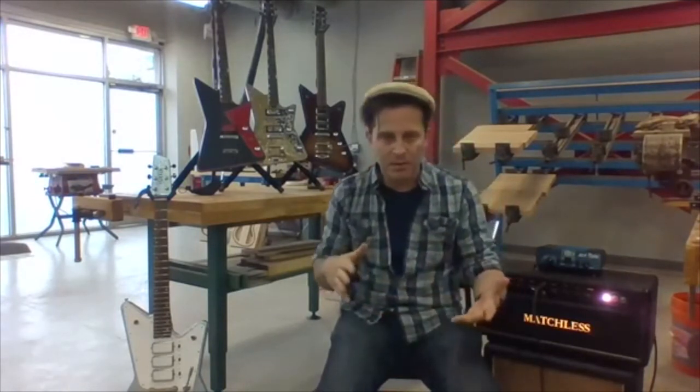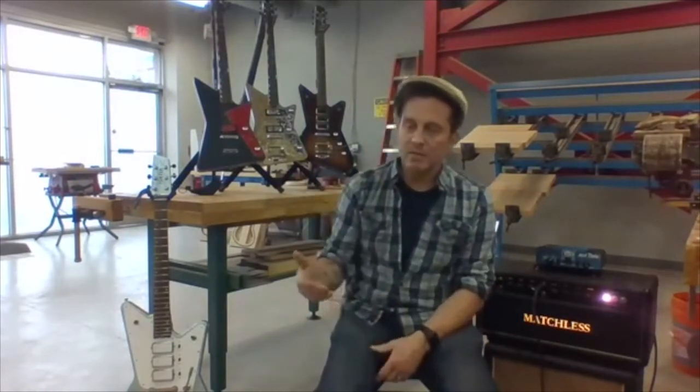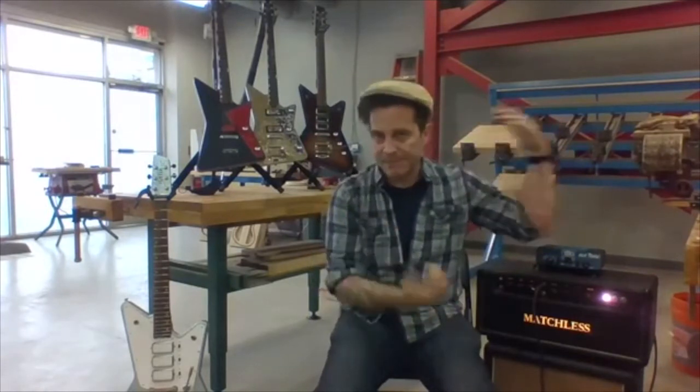They just didn't want employees sanding through the finish and into bare wood. So as time evolved, you start to see not only these catalyzed finishes, but also companies using UV cure. So you can shoot a guitar, stick it in a thing that looks like a rotisserie tanning bed for 90 seconds, pull it out, level sand it and buff it, put it in a box and send it off to whoever wants it.